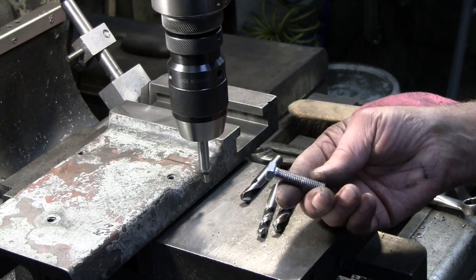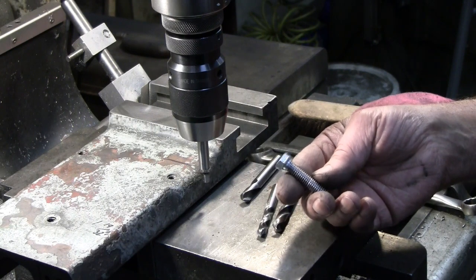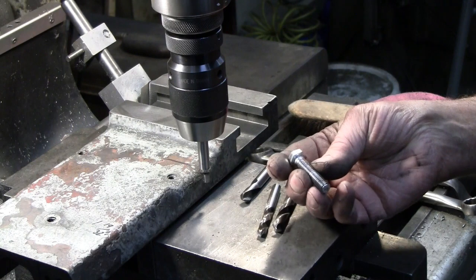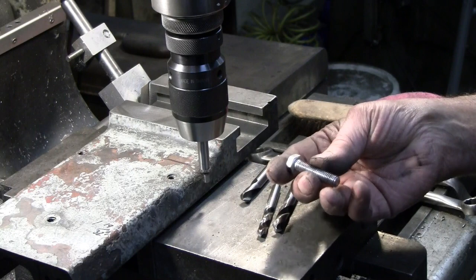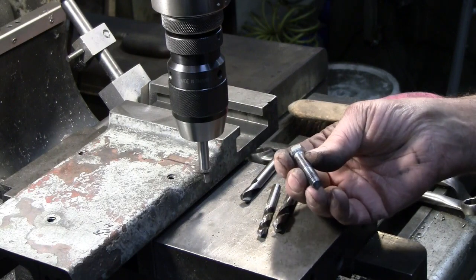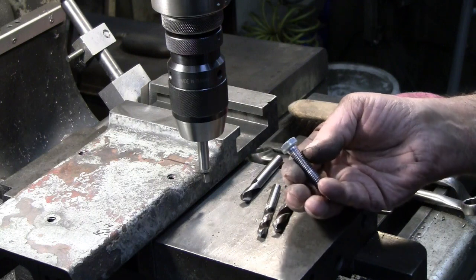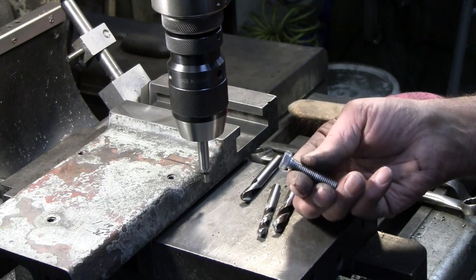For the moment I'm using a 3/8-inch by 2-inch grade 5 cap screw. I machined it down off camera to 1-inch and 3/4, pretty close, with a nice flat bottom and as little chamfer as I could achieve and still clean up the end of the thread. This will go all the way through and the counter bore will let the remaining few threads at the top clear.